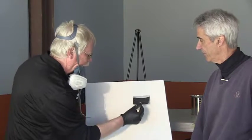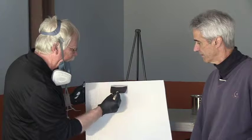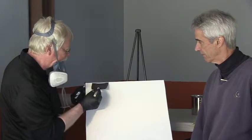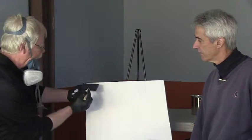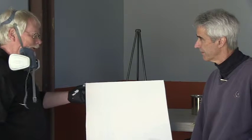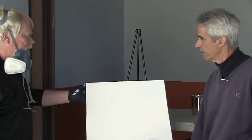So we're making a very thin layer of paint on this surface, right? That is correct. And if we're doing this correctly, Paul, when you're done with this complete job, especially if you're changing colors, you won't be satisfied with the finish. You'll say, boy, that didn't cover very well. I see a few shadows, holidays, maybe even a couple of spots that leave some streak marks. It has to be put on that thinly. If you achieve that, you're doing the job right, because this is going to require a second coat tomorrow.